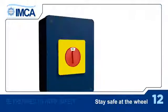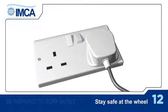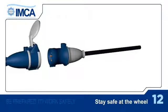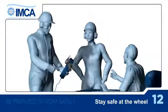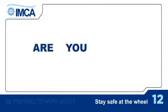When you've finished, don't disconnect from the power source by pulling the power cord or pneumatic hose. Switch off the power, disconnect electrical tools or bleed the remaining air out of pneumatic tools and put them away properly. If you spotted any defects, report them to your supervisor. Are you prepared?